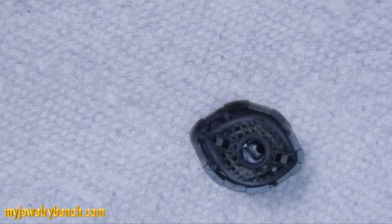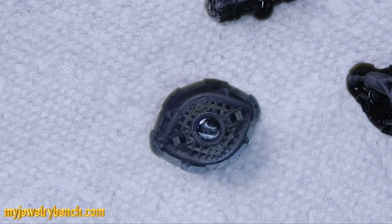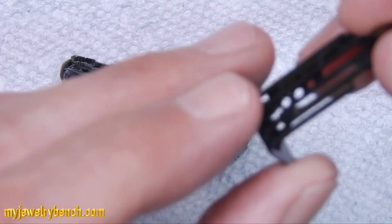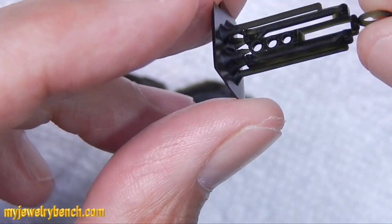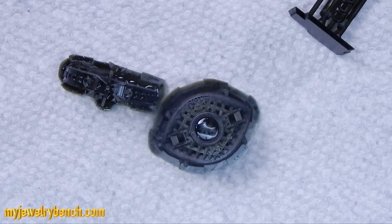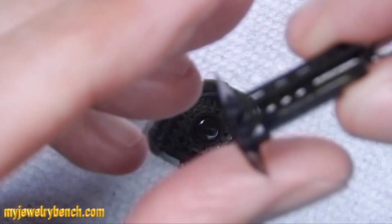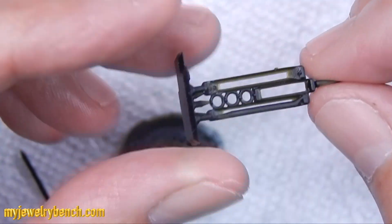So here's the settings that I used to get to this point, and I was pretty happy with it. I did vertical printing. I did 5 bottom layers at 45 seconds each, with every additional level at approximately 35 seconds, and I did a layer height of 0.04 millimeters. Anti-aliasing on or off isn't going to matter too much. The lower you have it, if you do decide to use it, the less goo and gunk you're going to get on your prints.